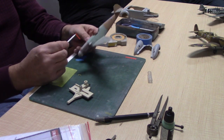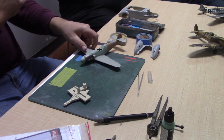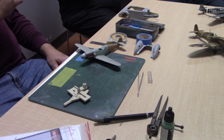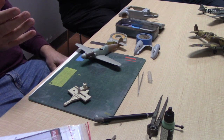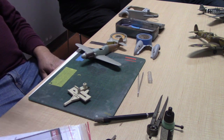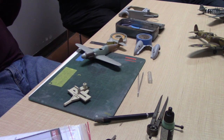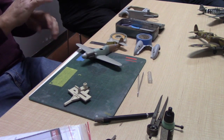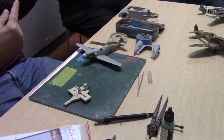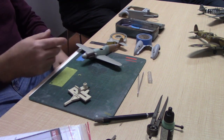When buying Dymo tape, it's hard to find because it's obsolete — although Doug once brought in boxes of it, so I've got orange and black. There's also a clear scribing tape which is thicker, and the advantage over the opaque Dymo tape is you can see through it. When you're trying to reconnect two panel lines, there's nothing worse than thinking you got it right and scribing half a millimeter off from the other one. The clear one works quite well for that.